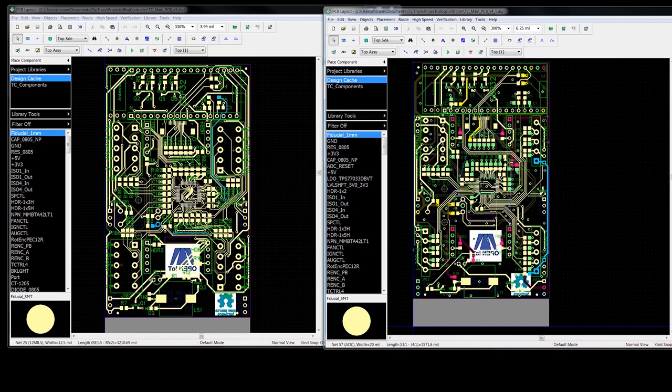There are actually quite a few changes in this. I re-laid out the whole board because version 4 now has four layers: a top, inner ground, inner power, and bottom. If you've been watching my previous videos, I think I mixed up these two layers — I called layer 2 power but it's actually layer 3. No big deal. That's probably the biggest change.